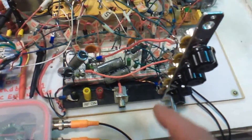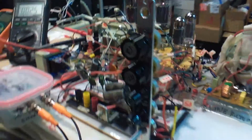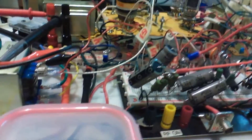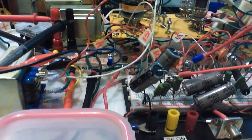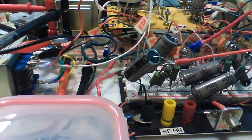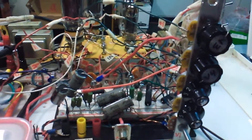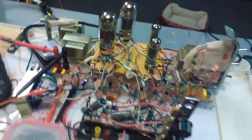We've got everything on a breadboard, like you get at Radio Shack. These are wire-wound resistors, five watts each — this is what balances the plate currents, actually the cathode currents. They're hooked to the cathode resistors. We've got high-voltage cathodes on the power tubes, running about 60-some volts on those. You need 500-ohm, 20-watt resistors for those. At 10 watts they run about 450 degrees — very hot. At five watts they were glowing red hot. So 20 watts on those. The schematic will be on our website; it's all open source, you can do what you want with it.